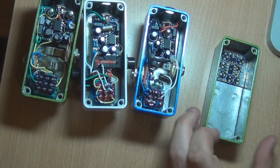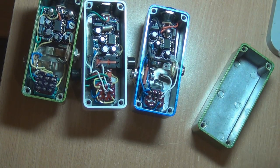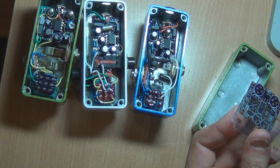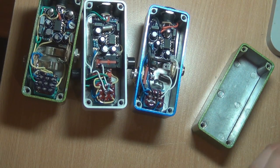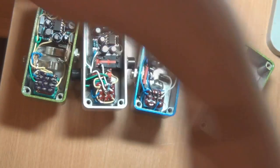The Face Master is at the maximum width it's going to be. So if you're designing one or selecting one to put inside a 1590A, according to this ruler — which is actually losing its print and is difficult to read — it's 32mm. I'm talking exactly 32mm, and as you saw it's very tight. So you probably want to aim for 31mm. The same applies if you're using an existing board not specifically meant for the 1590A. Just make sure it's not more than basically 3cm and you should be fine.